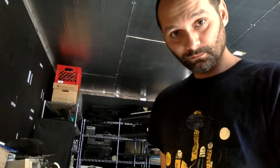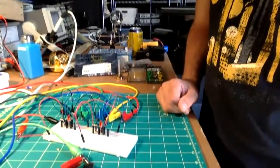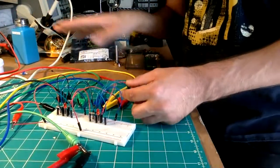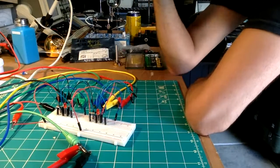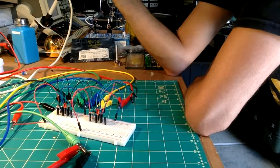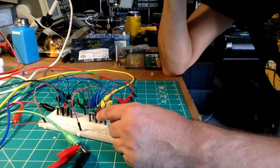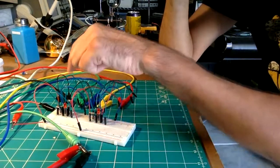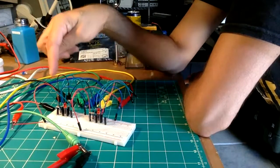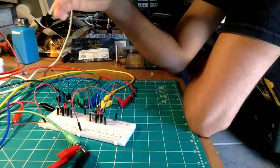So what happened? When I was messing around, I set it back up and disconnected a bunch of the wires, especially the outputs of the oscillators going to the potentiometers, because I knew something funky was going on there. In the last video, where we left off, oscillator 2 was working just fine and oscillator 1 was doing nothing. So I was like, okay, I'm going to reset up, get oscillator 1 to work, and start from there, kind of work my way backwards.